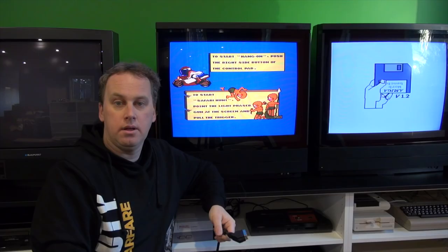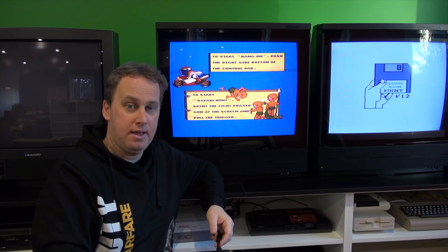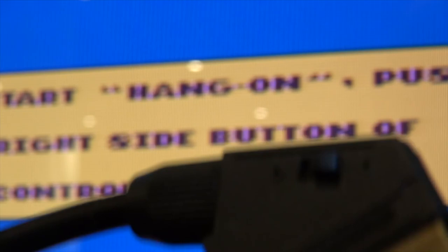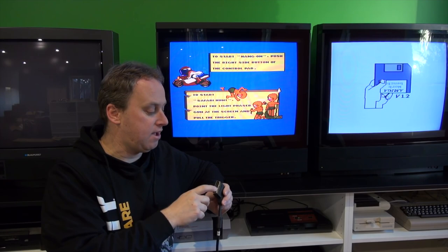We're going to have a look at what I'm doing with the TVs — the CRTs and how I connect them up. I'm doing a lot of wiring when it comes to the TVs. All my TVs, except for one, have a SCART RGB input. The signal carries sync, ground, and audio as well, though I don't route audio through SCART.